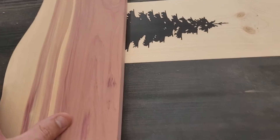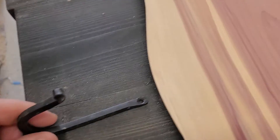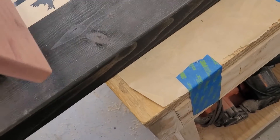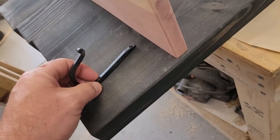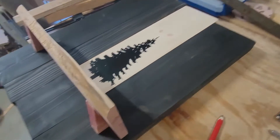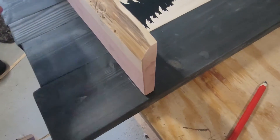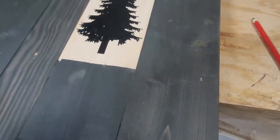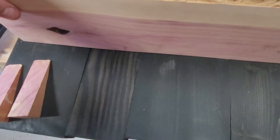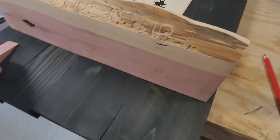Got some little wrought iron hooks online — I forget how much, it wasn't bad. Getting close on this one. I've drilled four holes to the back — was trying to figure out how I wanted to do it. I'm going to touch that up, but it's going to be hidden either way. Thought about doing pocket screws on the shelf, but honestly I don't want to have to deal with filling in the holes from the pocket screws, and leaving them open just wouldn't look right.